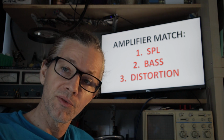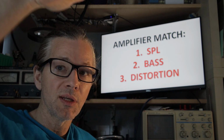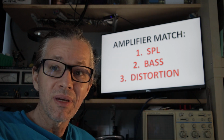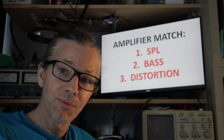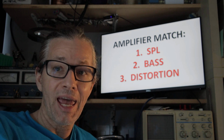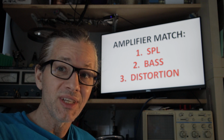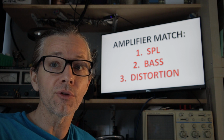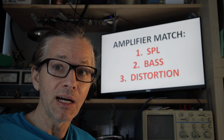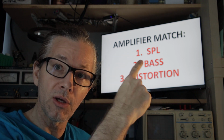And we are nowadays in a world where we have a variety of loudspeakers ranging from 16 ohms impedance down to below 2 ohms impedance. That below 2 ohm impedance pulls out 10 times the distortion from your amplifier compared to that 16 ohm loudspeaker. So yes, it's going to make a world of a difference if your point is actually sound quality and not just amount of sound pressure and amount of bass.